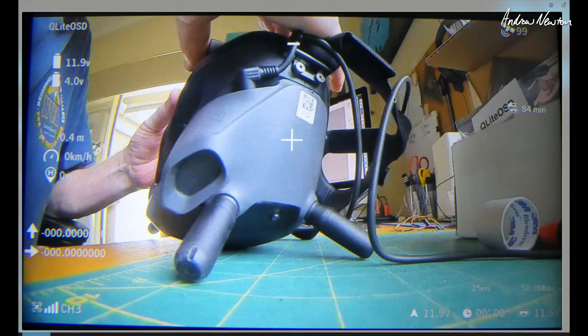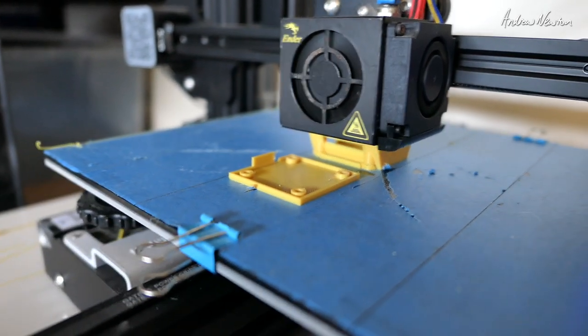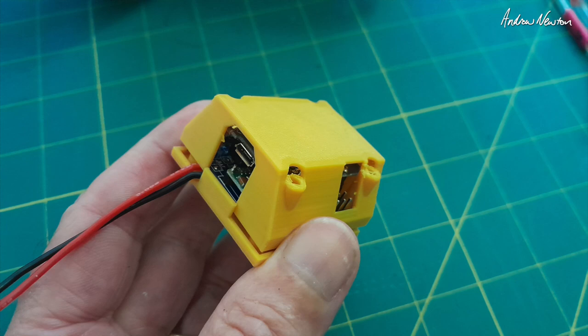Here's what we actually see on screen. The DJI stuff — battery time, inbuilt DJI OSD elements, and channel — is shown by default. The Q-Lite OSD adds its logo at the top, pack voltage and per-cell voltage, GPS coordinates at the bottom, altitude from the barometer, speed and distance to home from the GPS, a home arrow pointing back to home, a crosshair in the middle, and satellite count at the top. David has also designed a 3D printed case so you can download those files and print it yourself, which I did.